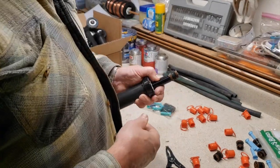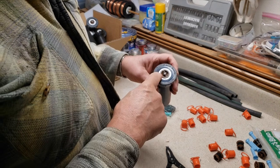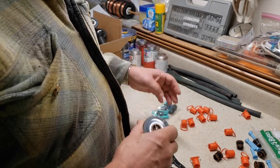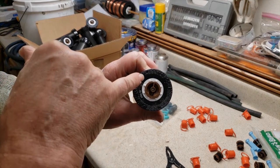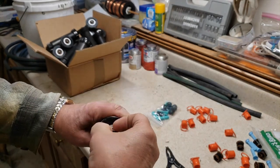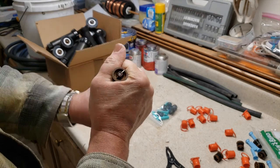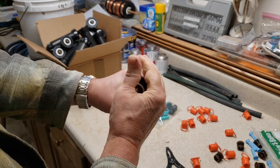And as far as adjusting these nozzles, these are an HE Van. This one happens to be a 12, and they color code them. 12s are brown, 8-footers are green, 10-footers are blue, and 15-footers, I don't remember what color those are, but I don't have any of those. And on the nozzle itself, it's got a little notch, and that's your left edge of your spray. So you can adjust where that left is. You pull the nozzle up, or you turn the sprinklers on, and you can grab the stem and rotate it and click it to whatever you want your left edge to be.